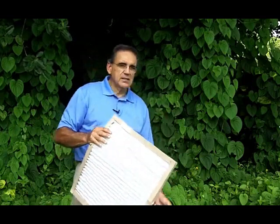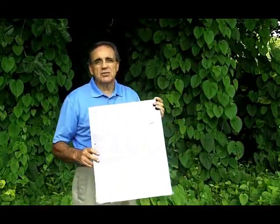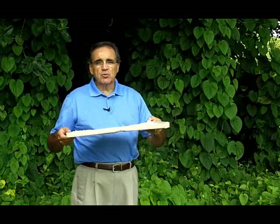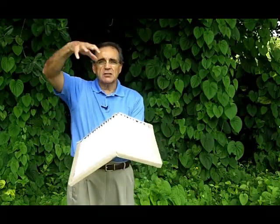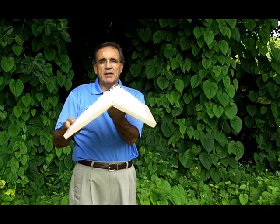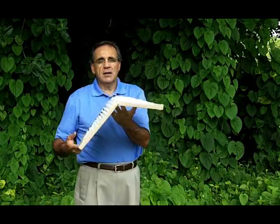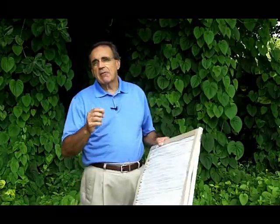Even though you may have one of these expensive filters, you may still say, I bought an expensive filter and I still see dust on my furniture — why is that? Well, one reason is this: sometimes when you put the filter in and the air conditioning starts to suck it up, it bends and kinks, especially if it gets wet. And then all the dust just goes right through it. One of the reasons I'm doing this video outdoors is to bring out this point: the Environmental Protection Agency — the EPA, a government agency — says that the indoor quality in our homes can be more dangerous than the outdoor quality.